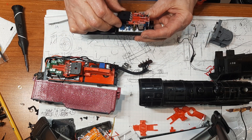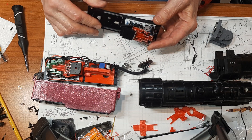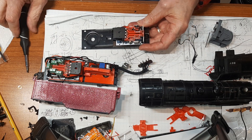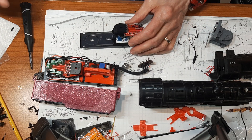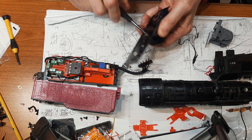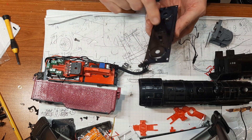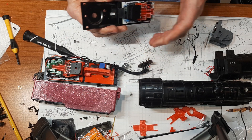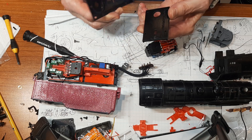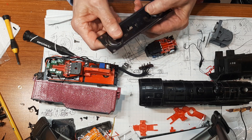I just put together this assembly with the customer's parts — we're now printing in black. These are all brand new parts, so I'm going to take it apart and let you see how it comes apart and goes together. We have an anchor screw that comes in through the bottom and we also have some anchor pins that will help lock and locate the piece. You see these pins will fit right into that groove.